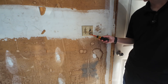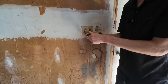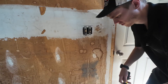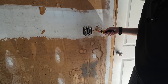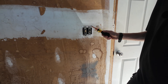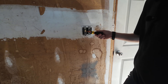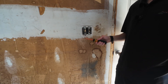First things first, we're going to take this face plate off. I apologize for any background noise — I am by a road, nothing I can do about it. As you can see, it's not always clean. The previous people who used to live here smoked in the garage, that's why everything's so tar-colored and gross. We're going to replace the three-way switch here and also swap out this old single pole for a nicer, heavier duty grade one. But everything in here is energized right now, so before you stick your hands or non-insulated tools in here, make sure you shut off the power.